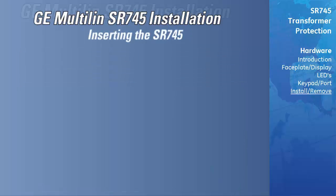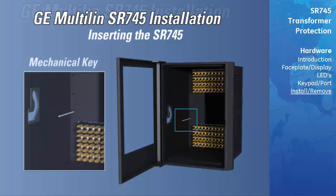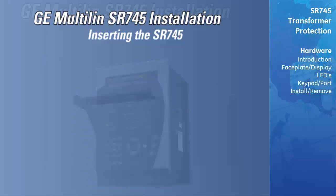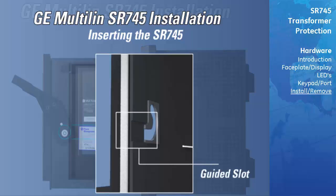Inserting the unit into the case. If an attempt is made to install a unit into a non-matching case, the mechanical key will prevent full insertion of the unit. Do not apply strong force in the following step, or damage may result. Raise the locking handle to the highest position. Hold the unit in front of the case and align the rolling guide pins near the hinges of the locking handle with the guide slots on either side of the case.